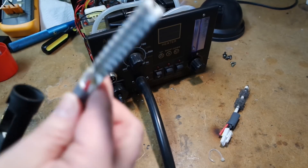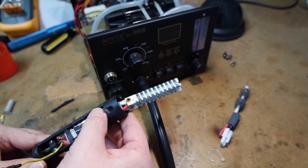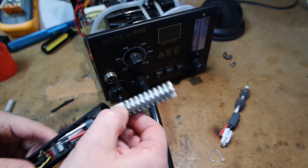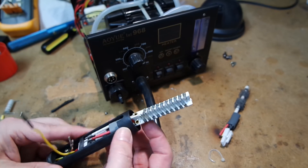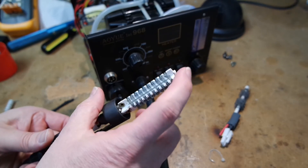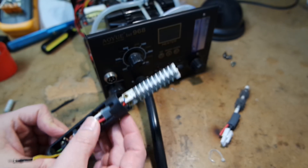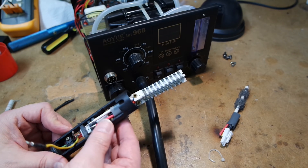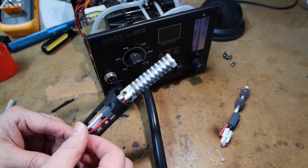I'm going to try to mount them — I'll be soldering them back together and I'm going to have to see if all the connections are long enough. By the way, these heating elements are 220 volts and they are rated for somewhere around 500 to 550 watts, which is quite a lot. But if you want to do reasonable soldering work then you actually need that power.